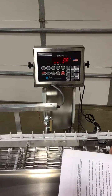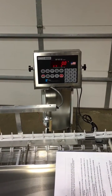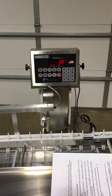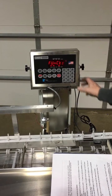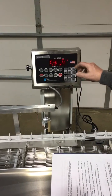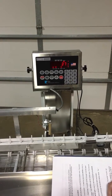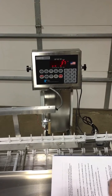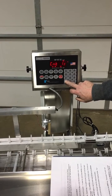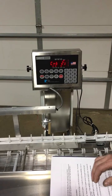To view the counts from your daily operation, you can get a count and accumulation for each grade. To get into this function, press the asterisk followed by the function key and it will tell us what we have for grade number one. Press enter and we've had 37 eggs. If we want to zero this, press the asterisk, enter zero, and press enter — that zeros that count out.